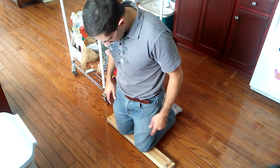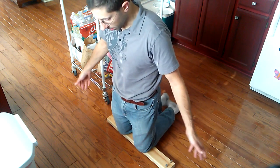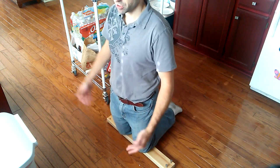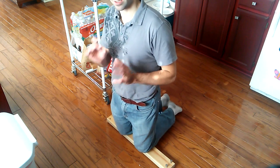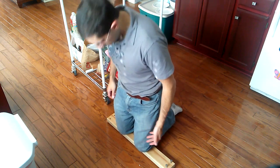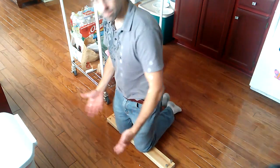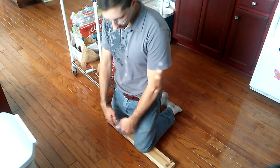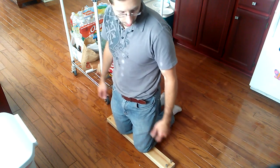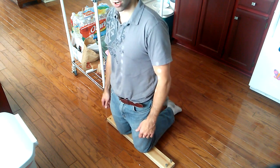One of the important things is just remember exactly where you put your knees. And so then, assuming you put the exact same amount of weight on it, you're going to taper the pipe almost exactly the same. You're putting the same amount of force on the pipe. So I know that I have approximately one-third. My legs are evenly split on the board here. So it's a good marker. Use that as well as the handle where that starts.